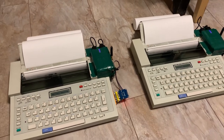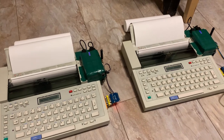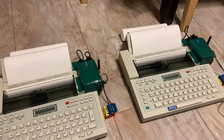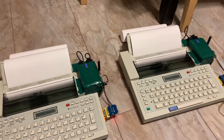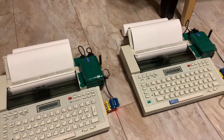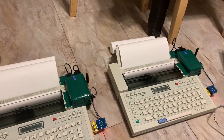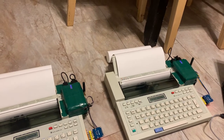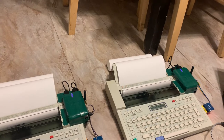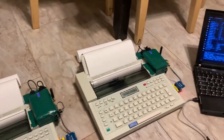But I was a little bit worried about encryption, because you can actually connect those devices in something called a LoRa wide area network, or LoRaWAN. But the point is, certain connections are not allowed, like some particularly long range connections are simply too slow for that. And I wanted to roll my own thing, to give the whole thing a bit more retro charm. So I came up with the following encryption scheme.